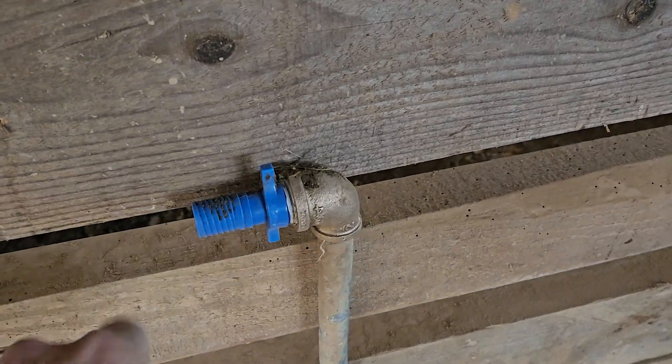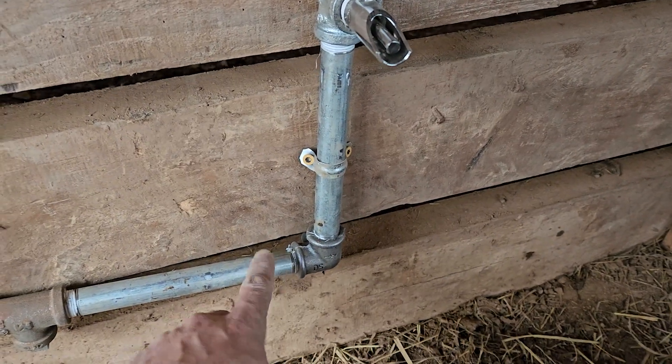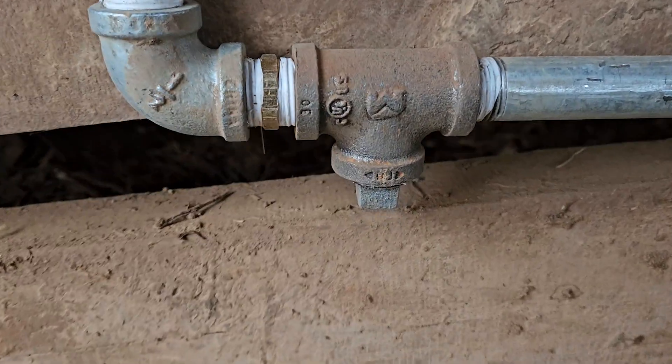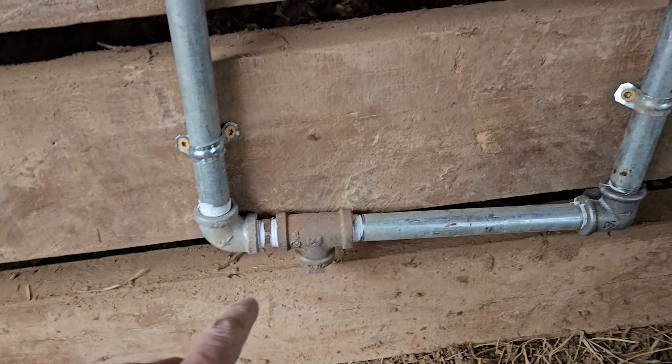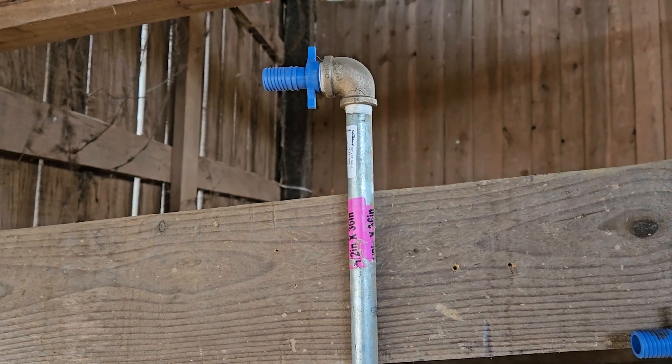Here's what we have: water coming in right here from the poly line, comes down to the first nipple, to a second nipple, going out to the other stall. What I've put in right here is just a drain — this is the lowest part in the system, so I put a tee fitting in with a drain right here, and then we just have our return pipe back up to a barb. I think that's good for the stalls. It's time to start running the poly line. I also have a diverter and ball valve assembly right in the middle of the system — I'm going to put that together and explain why I'm doing what I'm doing with the diverter and ball valves.